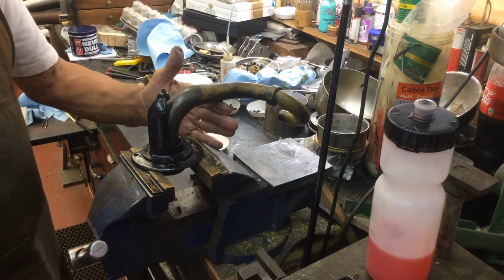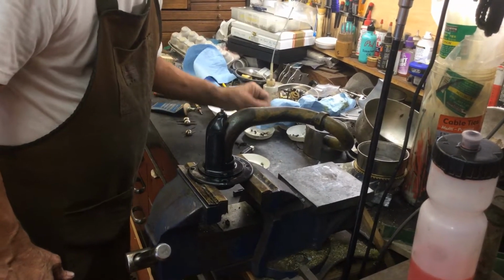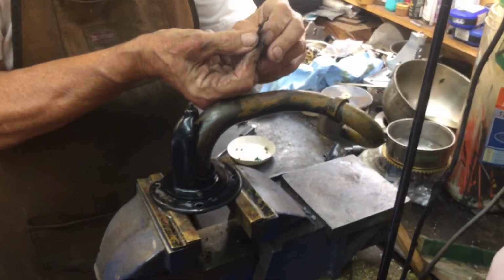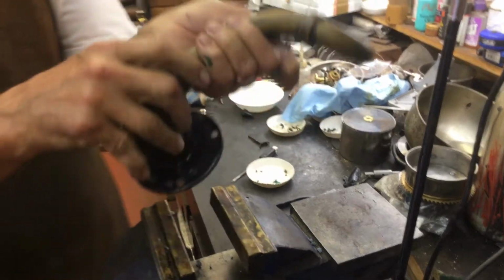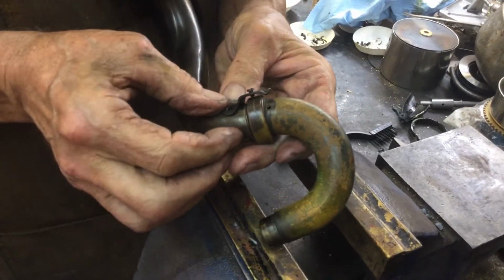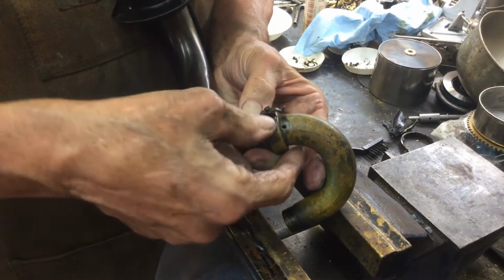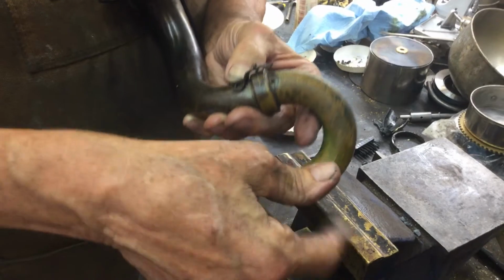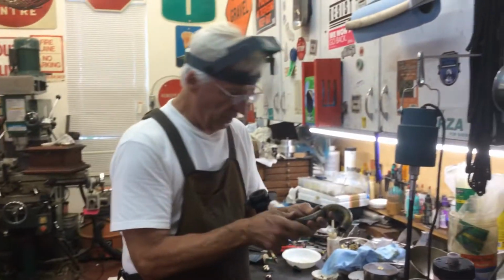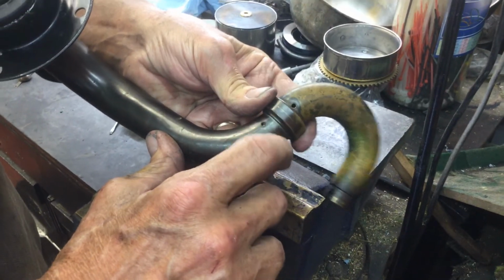And then you're going to assemble the brake part. This piece will go on the bottom. And this happy little piece is going to bolt onto the bottom. This piece here bolts here. And once you have everything set, you're going to screw that set screw down so this ring doesn't move. And then everything's going to be set. You have to reassemble the tone arm the way it came apart. And you can see here that the set screw had scratched it at one time. This had moved.